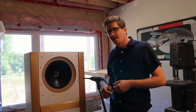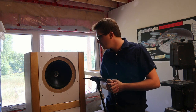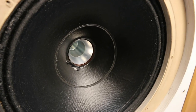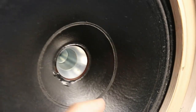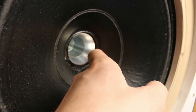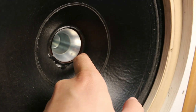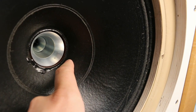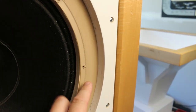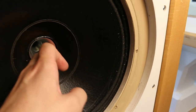This week we're going to try to smooth out the transition on the high-frequency horn. Looking at the horn coming out of the woofer, there are a few issues. The voice coil former is actually protruding out from the horn profile by about a quarter of an inch, and the cone is not connected to the very end of the former — it's back by maybe an eighth of an inch. We also have these ridges here, and for high frequencies it's not a smooth ride at all.